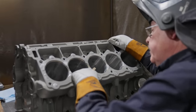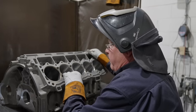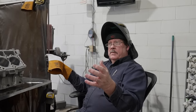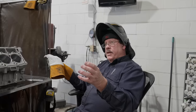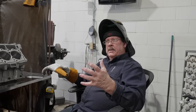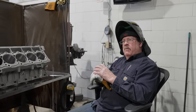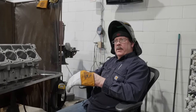Have you used the 5356 on billet stuff too? No. What are you using on billet? On billet I use a 4043. Okay. And then it goes to heat treat. One of my customers uses a dead soft billet, machine the head, I weld the plates, it goes to heat treat. In that process, anytime I tried 5356 going through the heat treat process, they would crack, because those plates are expanding at a different rate than that thick billet. And there's no silicon in it. So for that application, it's best just to use that rod. It allows it to flex. Even when they're running and the engine's torquing, it has that flexibility still in the weld joint. And 4032. Yeah.